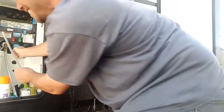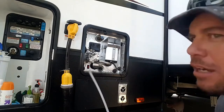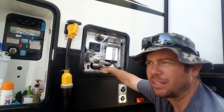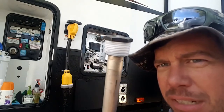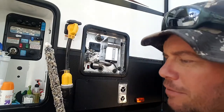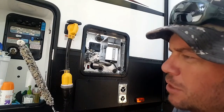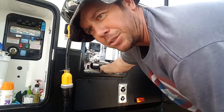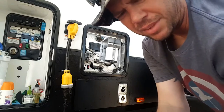I got all the water out — the top is still popped right now. You can reach in here and feel down on the bottom — a whole bunch of just corrosion. While we're at it, I put Teflon tape around it to help prevent the corrosion. This thing is basically only 50% done, so I technically could put it back in and wait another six months. But this could cost somebody two or three hundred dollars to have done professionally — nope, cost me two dollars and fifty cents for a 1 and 1/16 socket, and a rod runs about twelve to fifteen bucks.